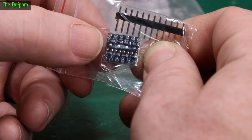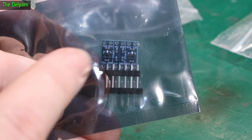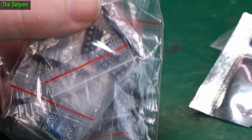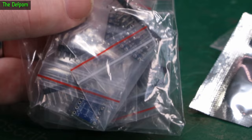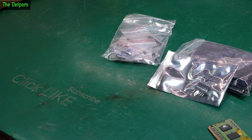They've only just arrived. Level shifters are very useful things to have. I did have some but they weren't the right ones — I wanted bi-directional ones. The ones I had were TX/RX only, so those are for UART systems. The new ones are usable on I2C and also SPI, since there are so many channels you can use SPI with as well. That's why I got both types — bi-directional and uni-directional. These are the ones I really needed, so now my board can get the job done.